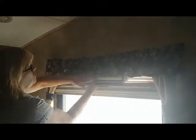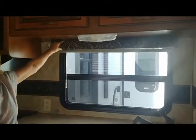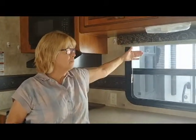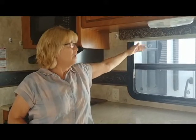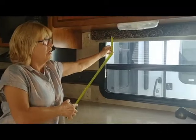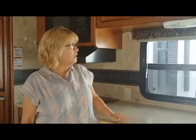The whole mechanism will be covered up by the drape, so you won't see it — it works perfectly. Kitchen windows: most kitchen windows have a small valance, so putting a double roller day and night shade usually doesn't work. I always suggest putting a night-only roller, because during the day most people keep their mini blind up, and you can put the rollers at any length you want. This valance has plenty of room to fit a night-only roller. Kitchens and bathrooms are usually this size of valance — just keep track of that when you measure.